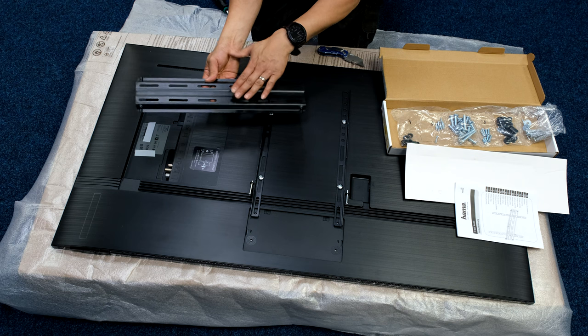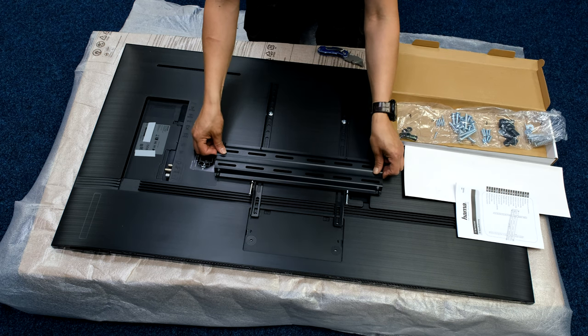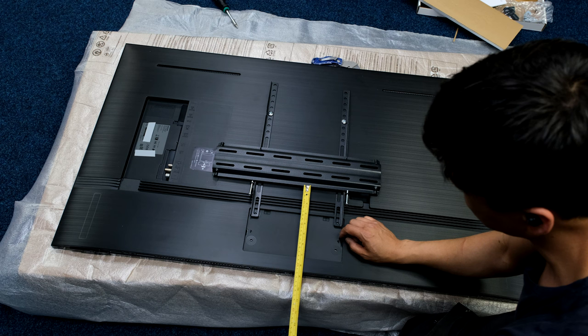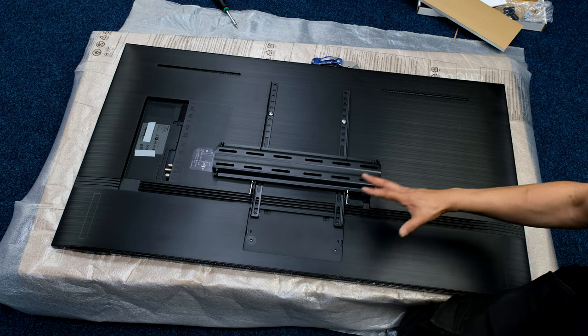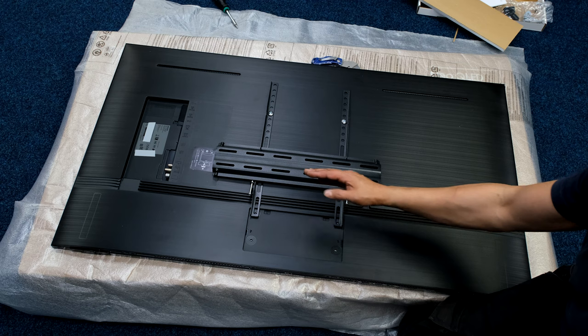So this plate is to be mounted to the wall. Fit it in there — we can see you've still got room to slide it side to side, although we'll mount it central anyway. From the bottom of the bracket to the bottom of the TV it's eight and a half inches or 21 and a half centimetres, so I can use that as a reference for where I want the height of my TV — bottom of the TV to the bottom of the bracket.